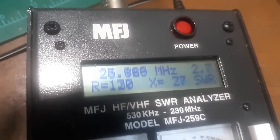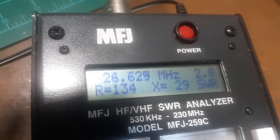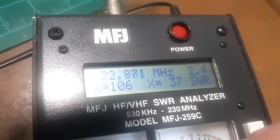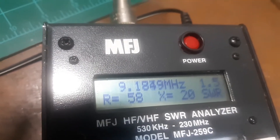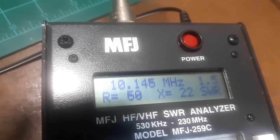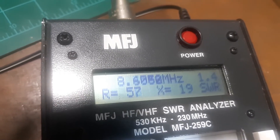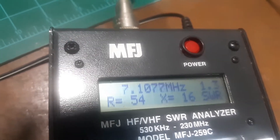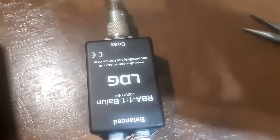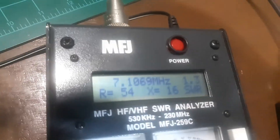It is not acting as a one-to-one balun at all above those frequencies. Even at 10 megahertz it's showing some reactance and resistance is up to 60 ohms. It's not acting well — there are some parasitics in there, some inductance, and it's not a perfect setup of course, but it should be much better than that for sure.